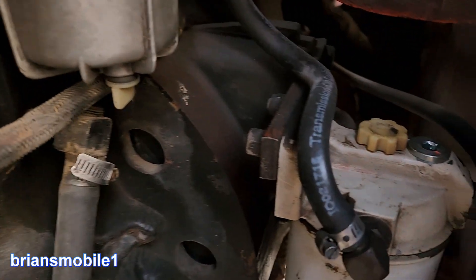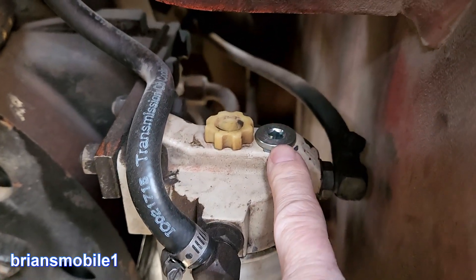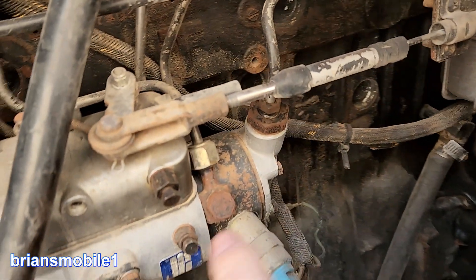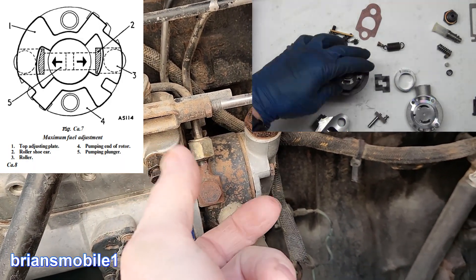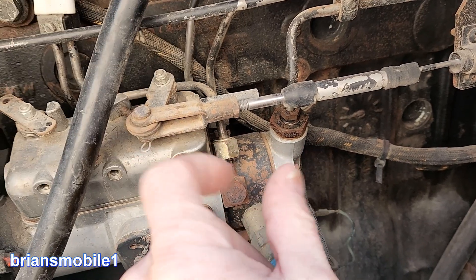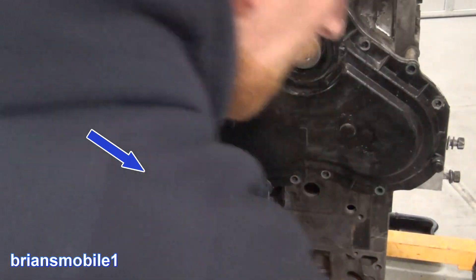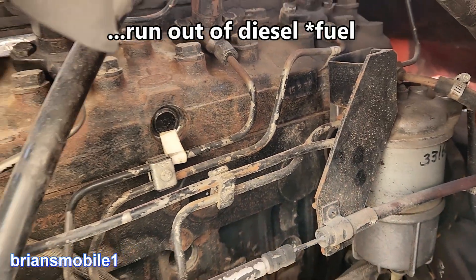If it won't open, it won't run. I had a problem — being old as it is — there was a plug made of plastic in this location and it leaked and broke, letting air in. When air is introduced into the distributor fuel pump, there's a little rotating mechanism with pistons that go up and down as it rotates. They have ridges like a flower and they expand and contract, pushing fuel together using pressure from the camshaft. That works fine until you run out of fuel.